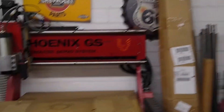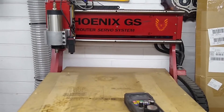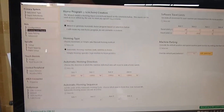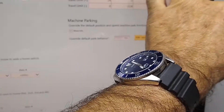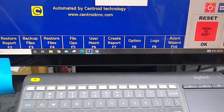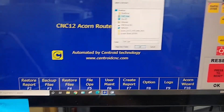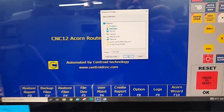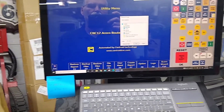If you have a different setup, take a minute to post a video just like I did. Show us where your switches are — mine is right there for Z positive, X negative is on this side, and Y positive is in the back. This could be a mill or a router. Always post a fresh report when asking for help, because the report has all the machine settings. Go F7 utility, F7 create report, browse to the folder you want — usually a USB drive — save it there, take it to your desktop, and when you go to the Centroid forums, post a fresh report. That fresh report should be the very last thing you do before uploading it with your questions.